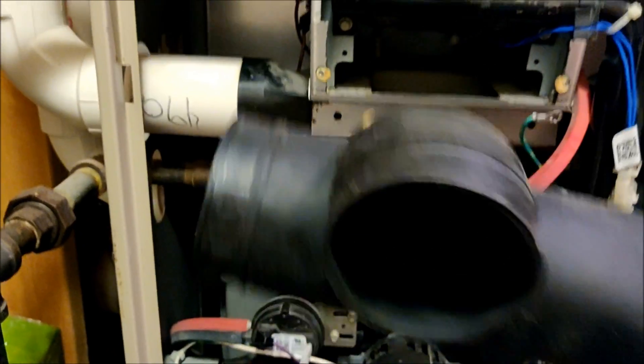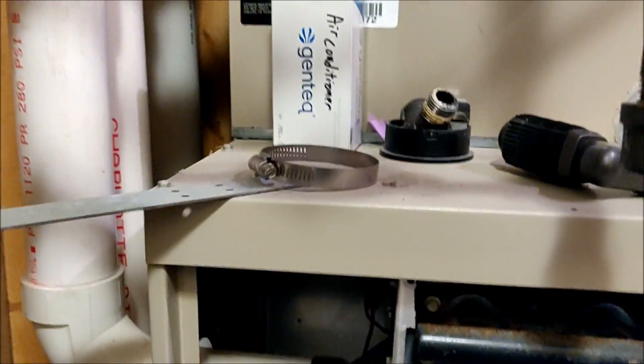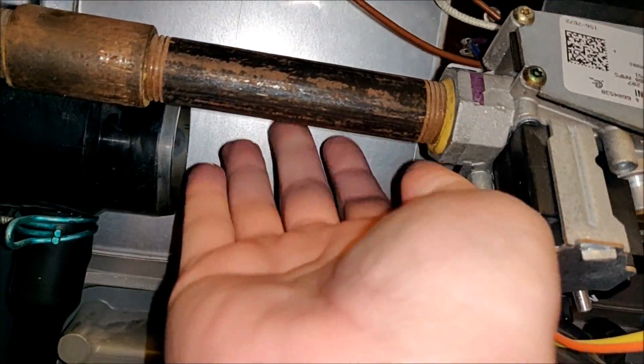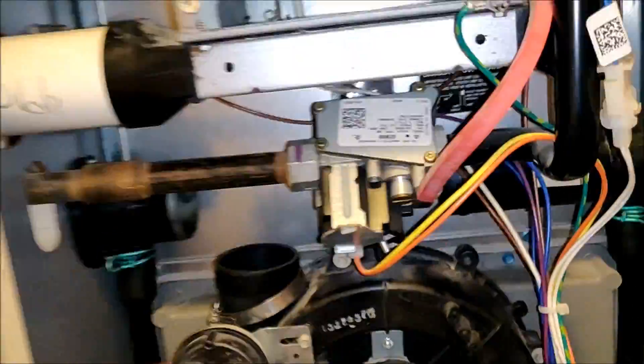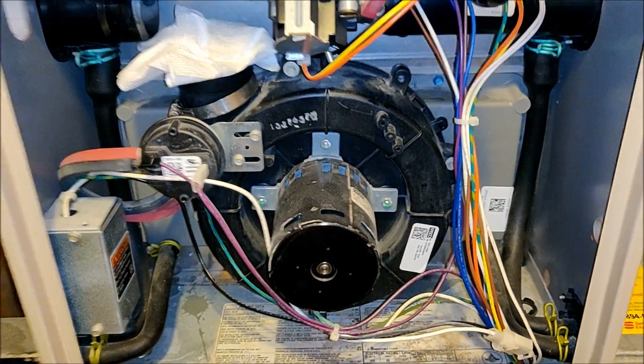With some effort we were able to get the rubber piece out — slipped it off the middle portion first, then shimmied it left and right to get it off. One of the radiator clamps was able to just slide down. That now gives us lots of room to get up behind here and up to where the flame sensor is. Before we try to get that screw, I'm going to stuff a rag or paper towel into the top of the motor opening — that way if we drop a socket or a screw it doesn't fall in and cause a lot bigger problems than we have now.